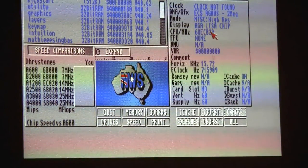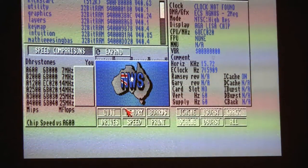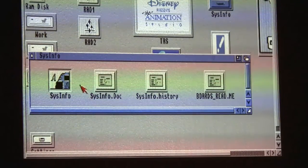The MIST board only has an 18-bit color decoder, so it has to translate from 24-bit to 18-bit to support AGA. So far the color representation looks pretty good across games and software — no obvious color weirdness noticed.